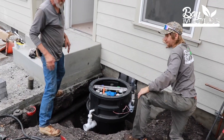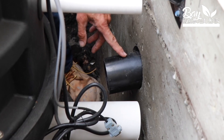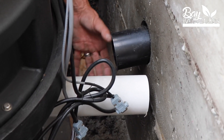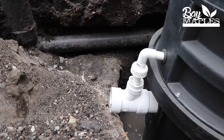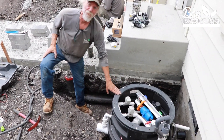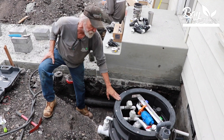We're very close now. We've got a pipe coming out of the wall — this is all of the showers and the laundry coming into this three inch pipe. We're going to cut this and put a simple rubber coupling on it. We're also going to cut into this sewer pipe right here — this is the main sewer pipe for the whole house — and this will be our overflow. So if for whatever reason there's too much gray water being generated or something happens to the pump, it'll still just be a pass-through to the sewer.